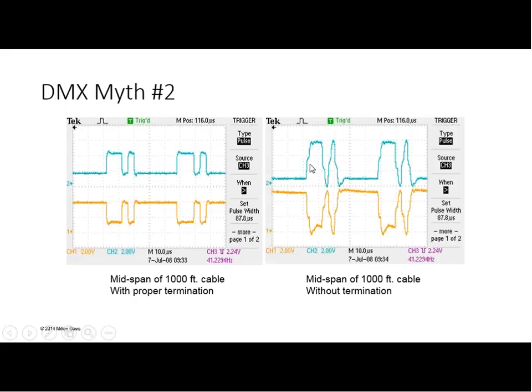As we look at this, can you really tell me where the transition from digital 1 to digital 0 is taking place, especially looking at this valley here and such? And with that valley, that's the difference between 25% and 50% on that dimmer. That's the difference between pan pointing stage right and pan pointing stage center. All you've got to do is move that valley 4 microseconds. Exactly.